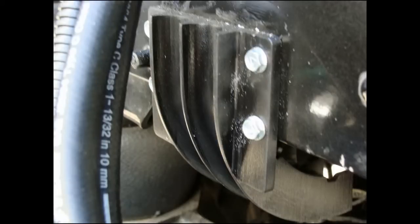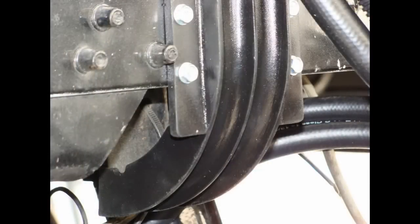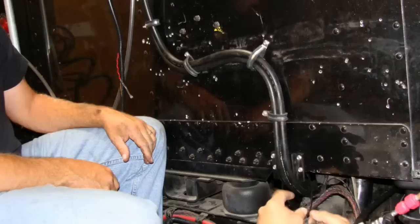Step 3: install the 90 degree hose support at the bottom edge of the cab to protect the flexible lines from damage. Use cable ties to secure the hoses to the 90 degree support. Since the IUS has a fixed amount of hose, plan to route and secure the excess hose.